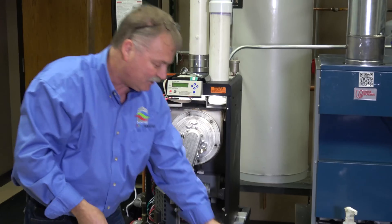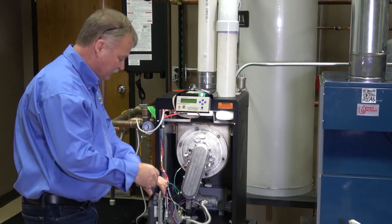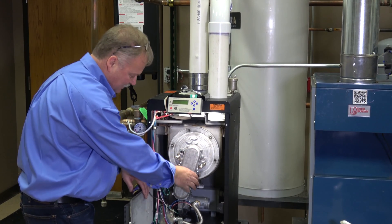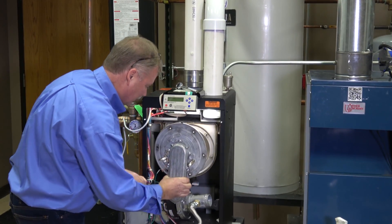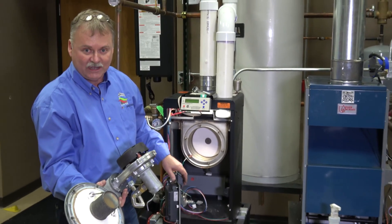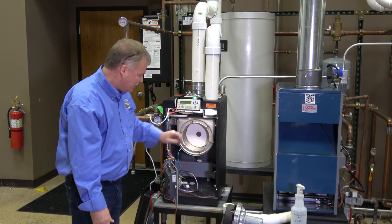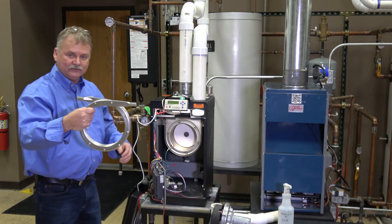There's our sixth nut. We've also pulled two molex plugs that hook up and attach to the blower motor. So now with the door open, just grab this and basically what we've done is pull out the whole burner door assembly in one shot. Let's set this off to the side for right now. Inside here, what you see is the actual coils.